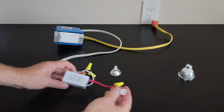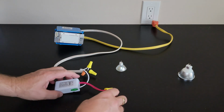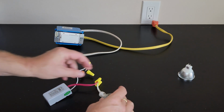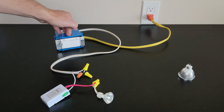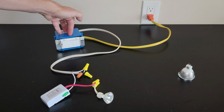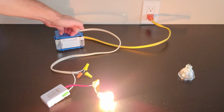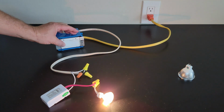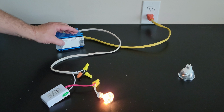With modern digital dimmers like Insteon 2477D, the minimum dim level and speed is set by the dimmer switch. Note, we do need greater than 10 watt halogen load to output any voltage. The output will flash strobe if the load is greater than 60 watts.